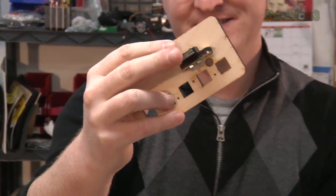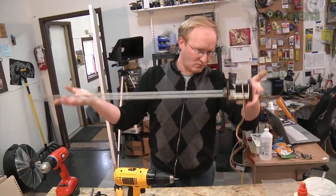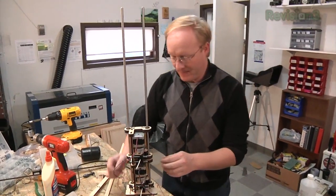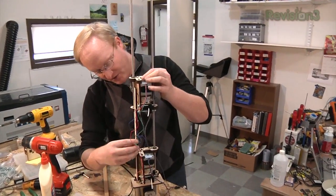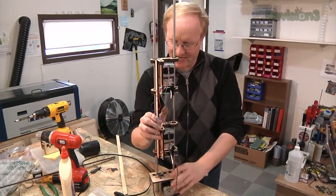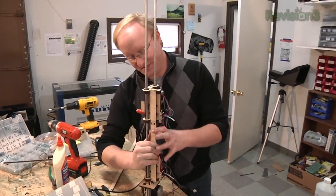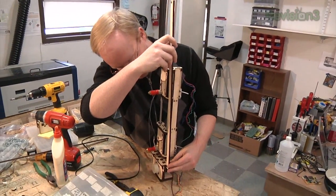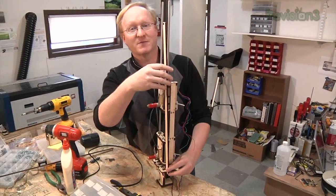Here's a limit switch. Here's the end of the Y-carriage with the drive motor. I've slid the two extruders onto it. I've got a linkage here that puts the extruders at the right separation and also binds them together so they move in tandem — like this. So this is literally meant to print two objects the same at the same time. And I've got a spacer here which is going to show me the proper distance to mount the other side of the X-carriage.